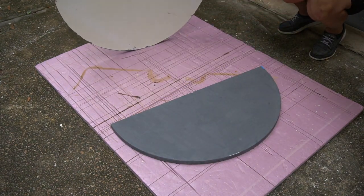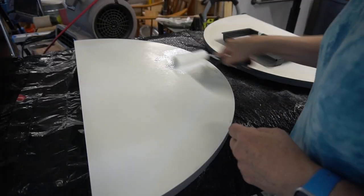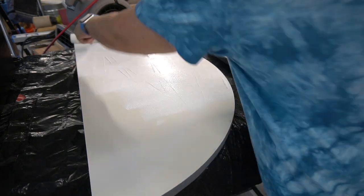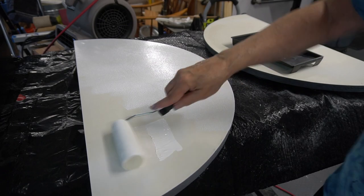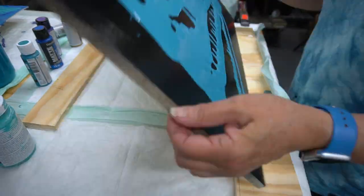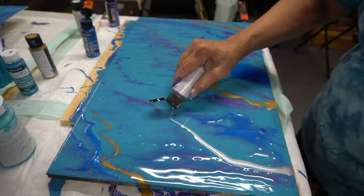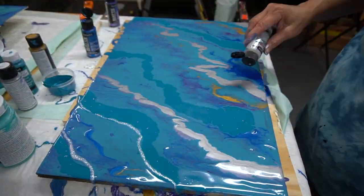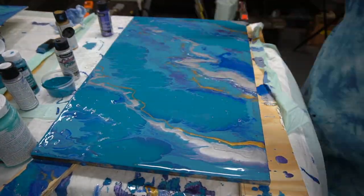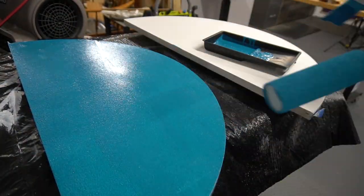This tabletop is Formica, or plastic laminate over particle board. To prep the Formica part, I first sanded and then coated the surface with Dixie Belle Slick Stick — a great product for painting over plastic laminate. The Formica side will be the back of the hanging bar. To add color, I'm doing a paint pouring finish using DecoArt paints on the interior bottom of the drawer. A full list of colors used can be found on our website. I let the paint dry for about two days before giving it an epoxy resin finish. I'm also using Bare Paint in the color The Real Teal on the back side of the bar and on the drawer.